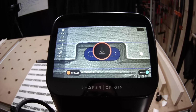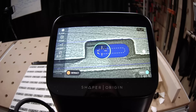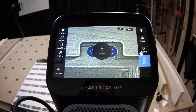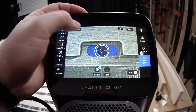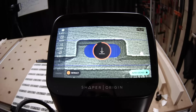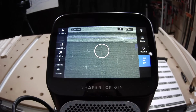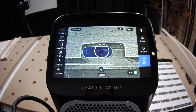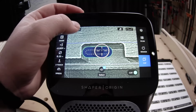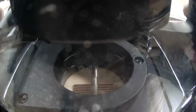They stock Soss hinges. And that's why we love using these, because they're pretty easy to find. There are some things about them that I wish were better. I wish they were adjustable. In the hardware catalog, we also have Sugatsune's brand of concealed hinges, and they actually have a line of small three-way adjustable concealed hinges. But these Soss ones are pretty good, and they're much less expensive also. Pretty ubiquitous, really good finish quality. Come with nice steel screws.